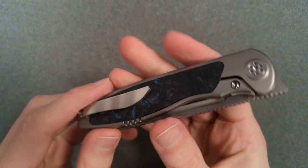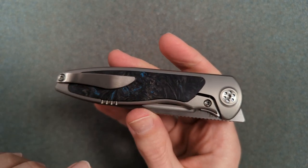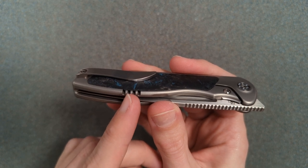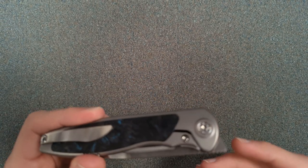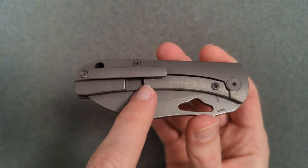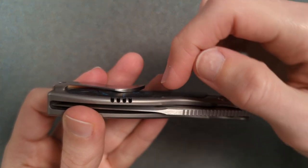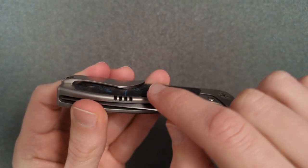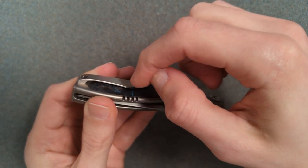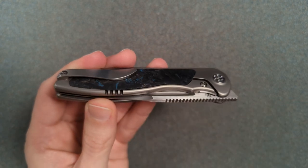You can see they're doing the lock bar relief as this kind of slotted style. On knives that have this type of slotting as the relief, if they're aligned anywhere in proximity to where the clip makes contact, your pants will run across this edge as you're trying to slide it in because this is where the clip is pushing your pocket material down — so it can act kind of like a cheese grater. But when you have this whole big smooth spot right here from the bolster inlay, that is completely eliminated.